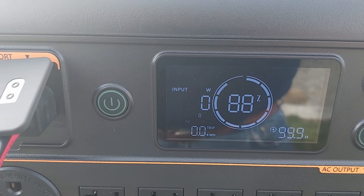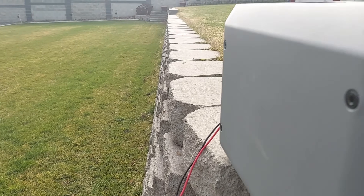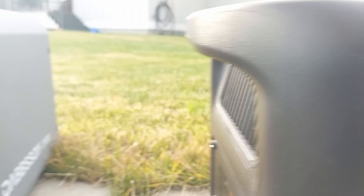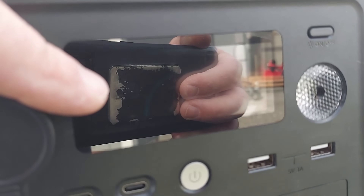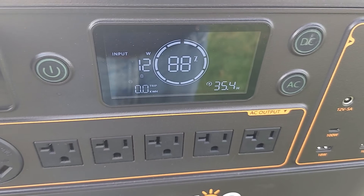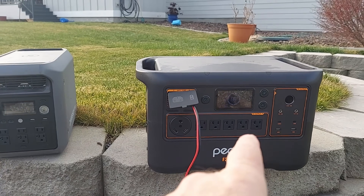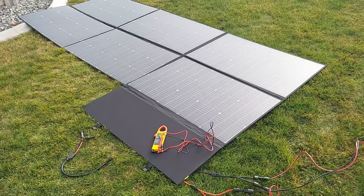I've got 80 watts on the other one — 36, 99. The sky is not cooperating real well. You see that? 49, 57 — that's your incoming power. 27 watts. When we do that over there, there's 50. I'm seeing 59 right now. We had 100 there a second ago. So we're actually splitting it — I've got 52 right now over here, 67 over there. So we're splitting it. It does work, though the light is kind of terrible — it's cloudy. That's a 600 watt panel, so I'd imagine we should be able to get a couple hundred watts out of it.